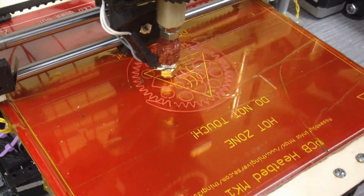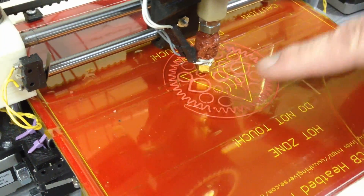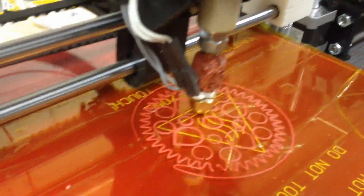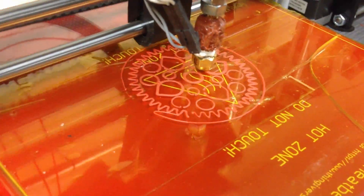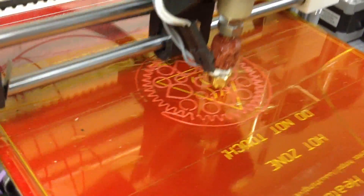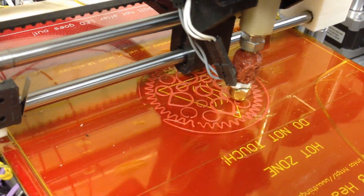This is running at 110 degrees Celsius — so it's a couple hundred degrees — the heated bed. And you see the glass is cracked in it. The hot end there, that white wire, is actually a thermistor, which measures resistance and yields a temperature. 210 degrees Celsius there, which is around 400 degrees Fahrenheit. So it's pretty hot, and that's the temperature that ABS happens to work at.